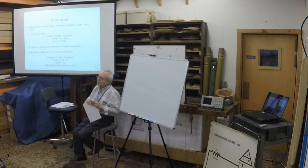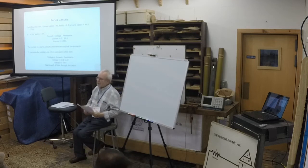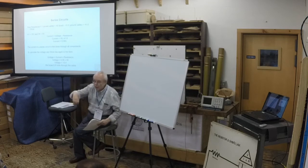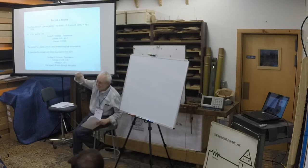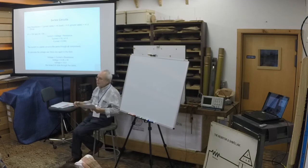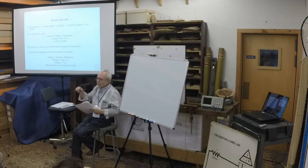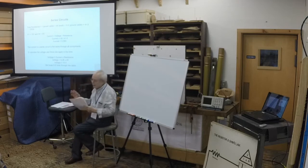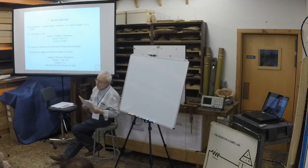Years ago I was asked to look at a Hildebrandt organ in New Haven, and they had a massive 150 amp Orgelectra in the attic. It was so impressive it had an eye hook on the top for craning it in. The organ was a big 3-manual tracker with lots of current-hungry slider solenoids. And if you pushed divisional pistons, it was sort of okay. When you pushed a general piston, it just barely worked, and I can relate to what that feels like.